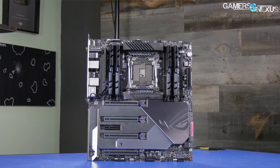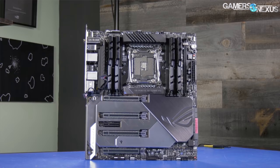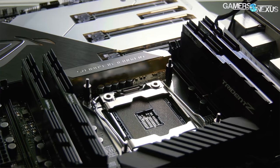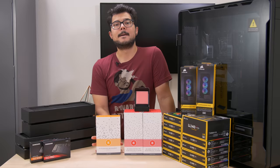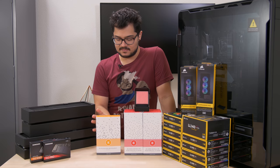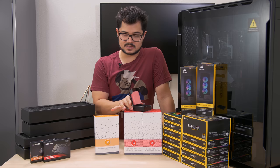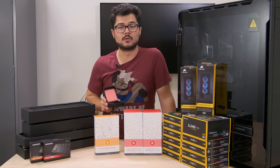It should be pretty exciting. But during his testing — and you guys should definitely go check out his video, I'll put a link in the description — he found that the Rampage 6 Extreme motherboard was actually throttling the core frequency due to an overheating VRM. Because of that and Steve's infinite wisdom, I've decided to invest in an ASUS ROG Rampage 6 Extreme monoblock that will hopefully lower the temperatures on our VRM enough so we don't encounter any thermal throttling.